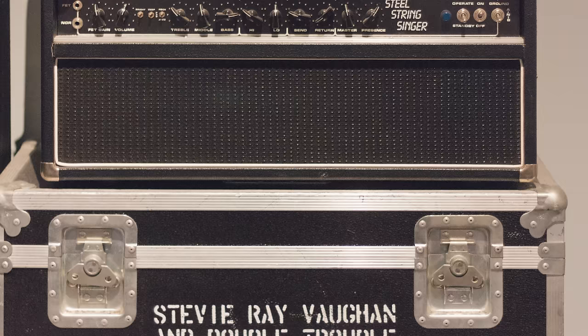That's when you hear that really percussive quality, when you hear the string slap back on the fretboard and you can even hear the flesh in your fingertips. That's the cathode follower really kicking up the output, but you don't hear the distortion. So that's the idea: you have the Overdrive Special tone stack and preamp, and then it goes into the cathode follower, which really kicks that up, and then goes into the output section.